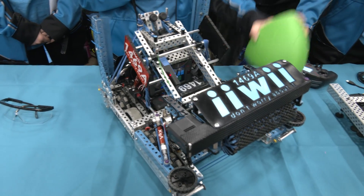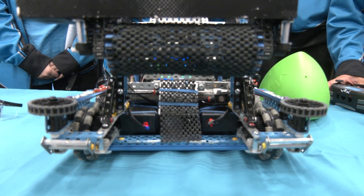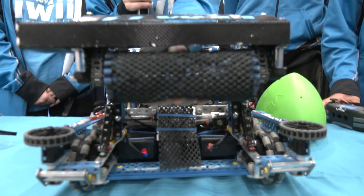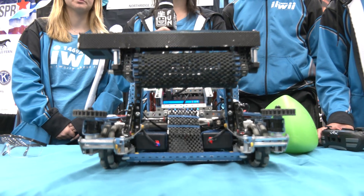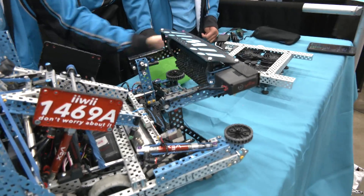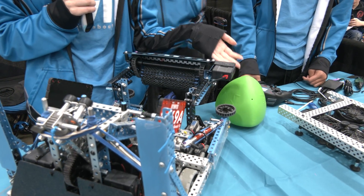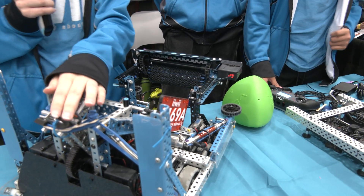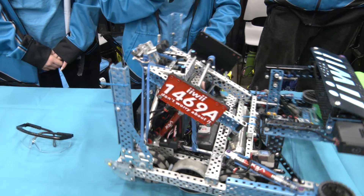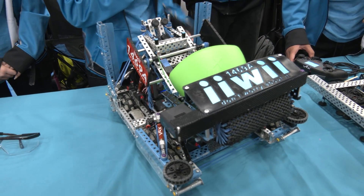What you'll see here is it's a very basic intake. We have the rubber band at the bottom to hold the ball up, and a ramp made out of mesh that's just zip tied in — it's not technically what other teams would call a real trap door, but it works very well. The mesh on the front gives really good flexibility. It's double-chained, and we have a cool plate on the front which actually protects the chain. It's really good for the camera because sometimes it's hard to see who is who on those overview perspectives of the field. As you can see in the back, we're running a 5.5-watt motor — a decision because we ended up giving that other 5.5 to our kicker. As of now we're 10th in skills, and it's also just top-load, which has been really convenient for us in match — we can pop it in and go.